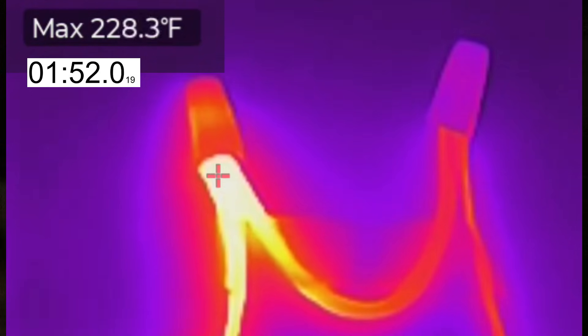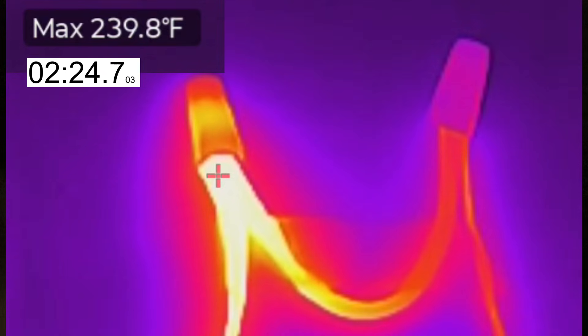As I speed this up, you can see within only two minutes that wire nut is now starting to get hot as well — starting to get a little bit soft under that heat, and the spring that's inside that wire nut is also starting to deform under that heat. That's allowing the connection to loosen up even more. And here we are under three minutes, and we're already at the temperatures where some wire nuts are going to begin to melt. The splice on the right that looks normal and has no problems will eventually start doing the same thing as the splice on the left. It's only a matter of time.